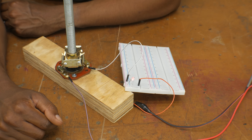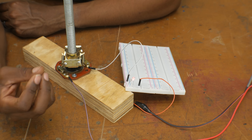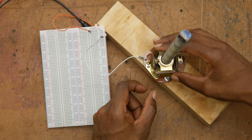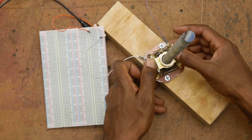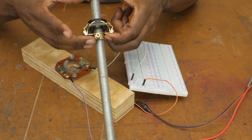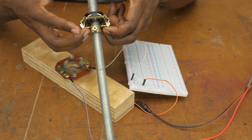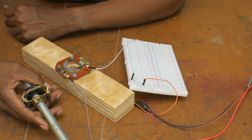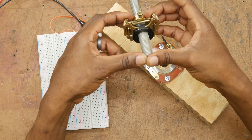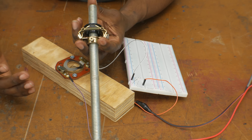But remember, we only want this connected for maybe half a second or so — really, once the motor gets up to about 80 to 90% of its rated speed. As this starts to spin, these weights tend to want to fling out. This tendency is something you've experienced before — if you've ever ridden a roller coaster, or made a hard turn in a car and felt your body weight shift to one side, that same force causes these weights to swing out away from the center.